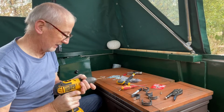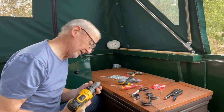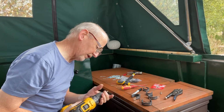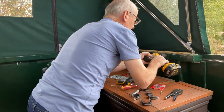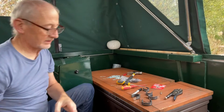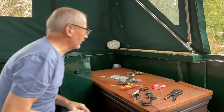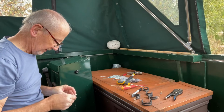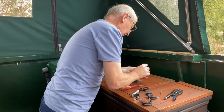Finally, we're through. So let's just make sure, and get your 5mm thread in there. I've drawn the hole out 4.5mm using a high speed drill bit. Yes. The good news is we've got a hole. So let's make sure. Definitely fits okay, and the fan comes together.